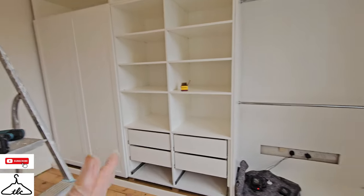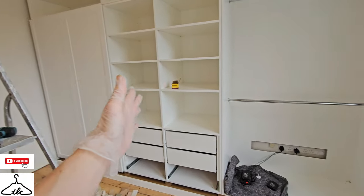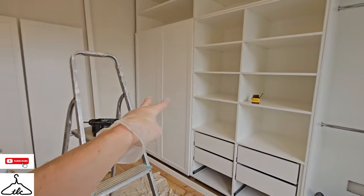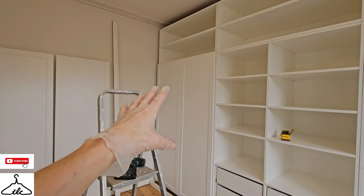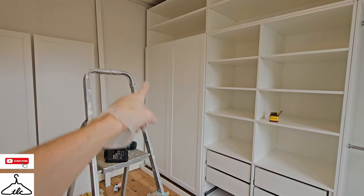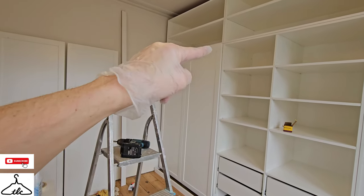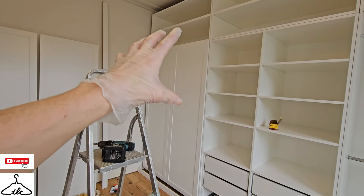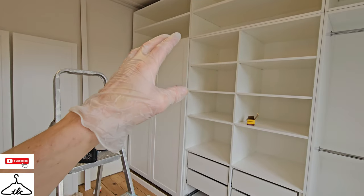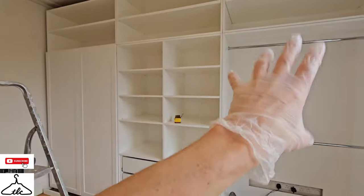Anyway, I'm going to crack on. Sean's finishing that run off so I can then just get all my doors. I think I am going to get my run of doors because we cut a whole set. So we used a 10-foot sheet to cut up four doors. So we had a whole panel. Then we slice it down the middle and then we slice at the top to give us four doors. Okay, so I know that they're all going to line up perfectly. Well, hopefully that's the plan. And then we got another set and another set.